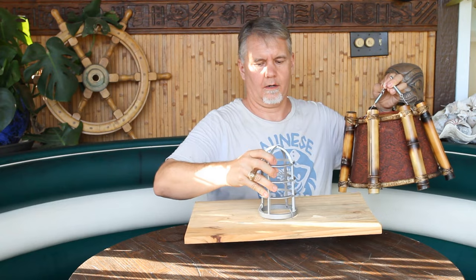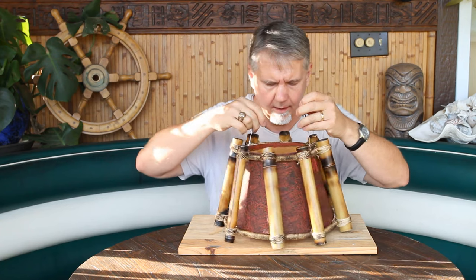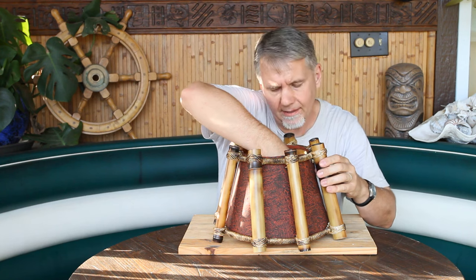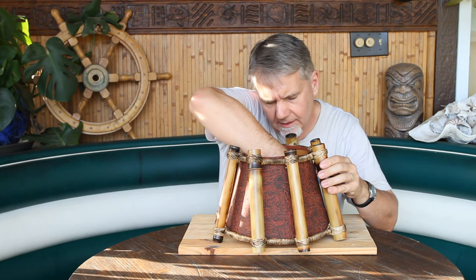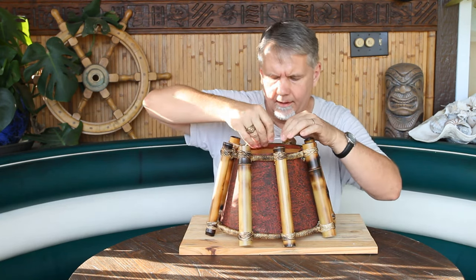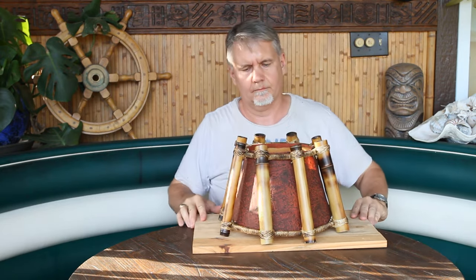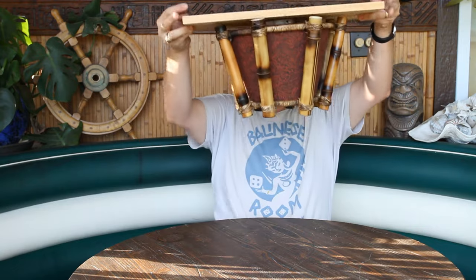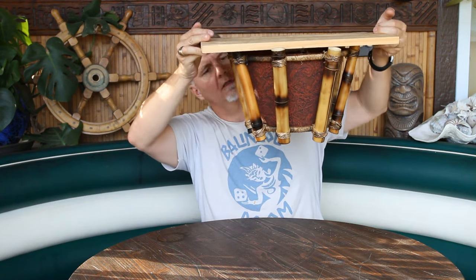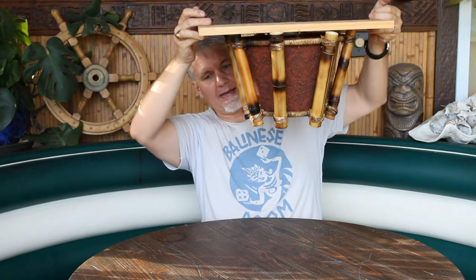And this is how it's going to work. The frame goes in here. And reach in. Fortunately, it springs, so I can move this to one side or the other. Give myself some extra working room. And there we go. Springs in place, hooks in place, holds the shade flush with the ceiling, covering the lamp.